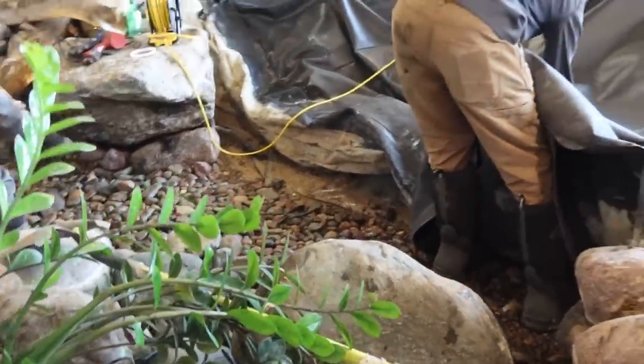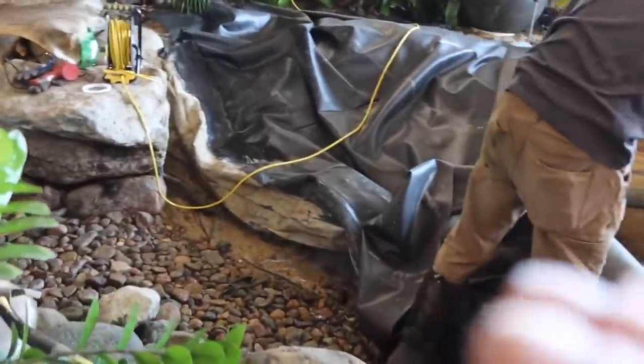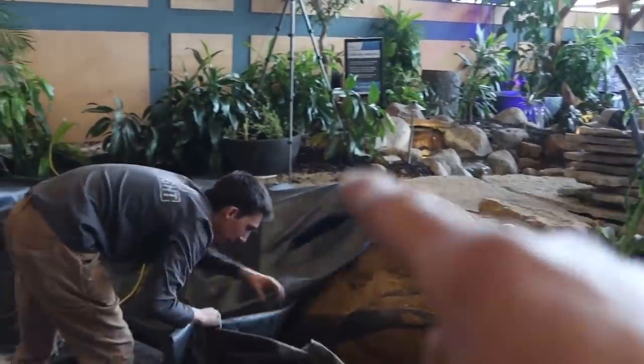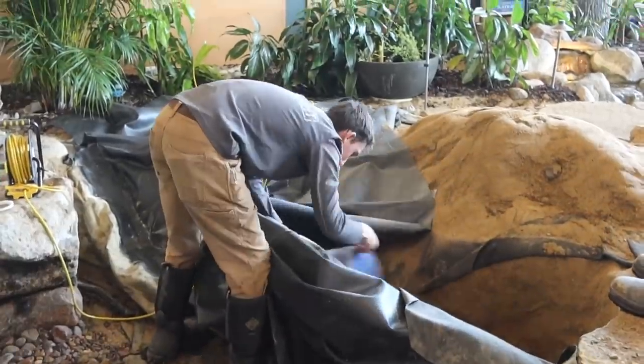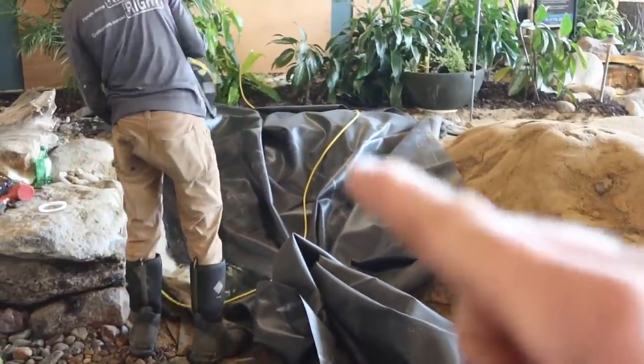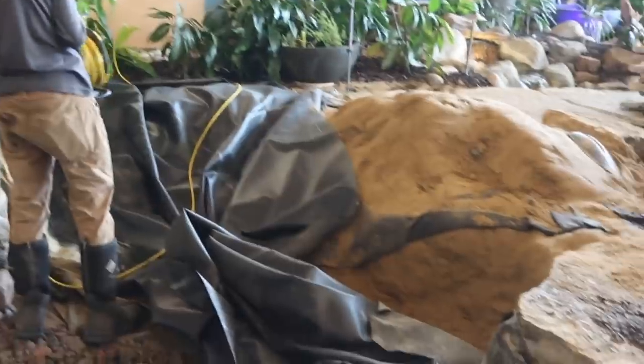It's going to be important that we set elevations correctly when working in this area. Set that bottom course right at the appropriate height in order to compensate for the thickness of the patio there. So we'll kind of have to reverse engineer our way down from the top of patio to figure out the thickness of our brick, how many courses we're going to need, and then what the bottom course elevation will be as well.